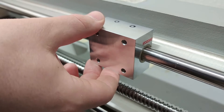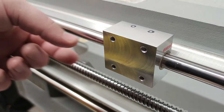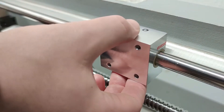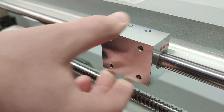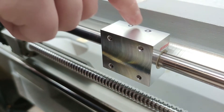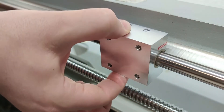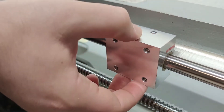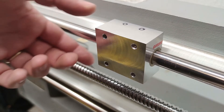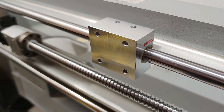The plastic used should be very resistant to wear, especially on hardened and ground precision shafts. But in case they come loose in the future during use on the machine, I have a solution. Currently the bore is finished to the final diameter with no adjustment possible, but I can make a slot with the slitting saw and then tap some holes for set screws from the side to adjust the tension on the rail. I can then adjust the individual blocks for a good fit and reattach them. It can lead to uneven wear and lower precision, but in that case I can always glue in fresh plastic and bore the hole to tolerance again.